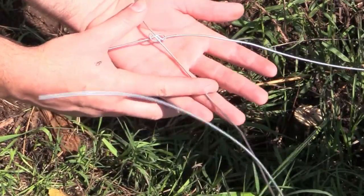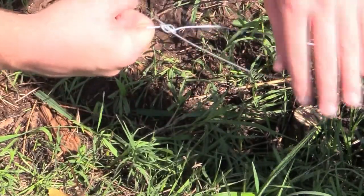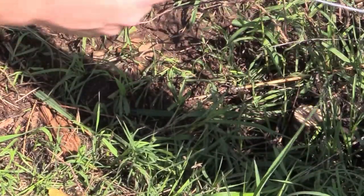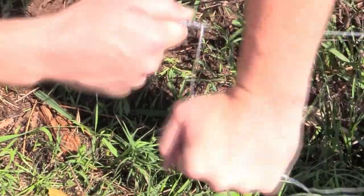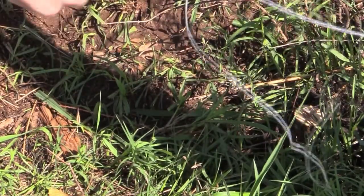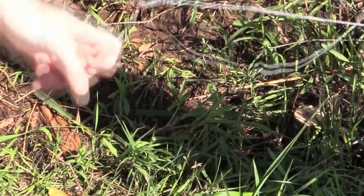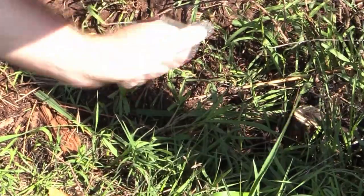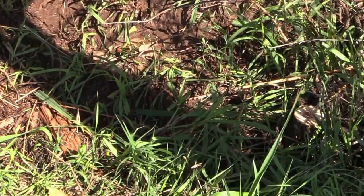Some people will clip the tails and leave it right like that. I like to tie it off — you'll take the existing wire and follow right along there, then finish it off with about three wraps. You can wrap it as many times as you want, but three tight wraps is good. Same over here — continue along that wire. It's a lot easier to wrap on strained wire. We end up with a knot that is pressing on itself rather than on a specific spot.